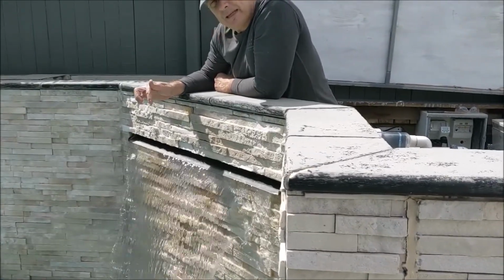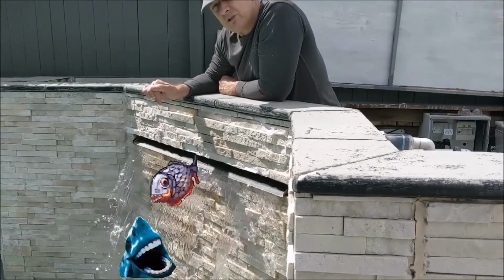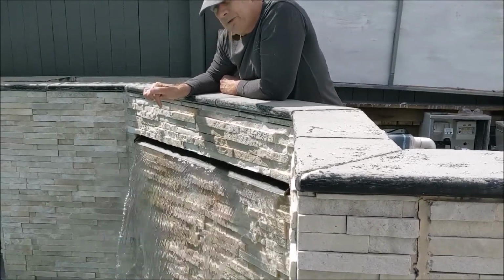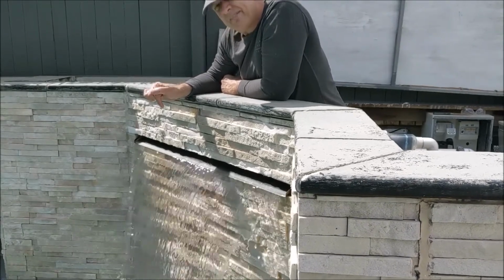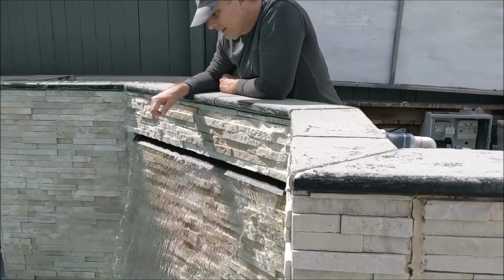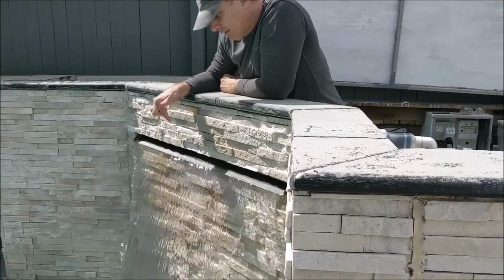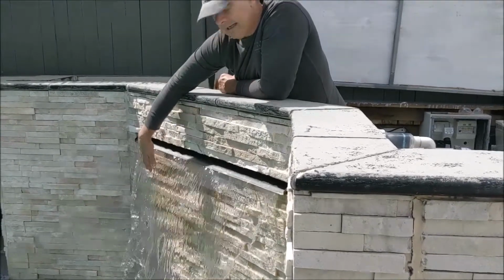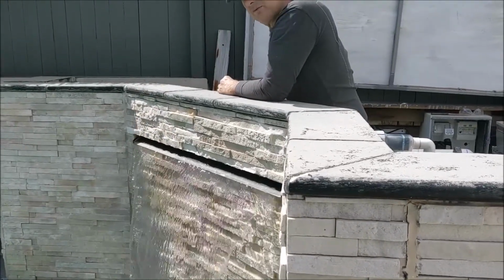I haven't got a power meter, but I reckon the power savings here, based on what I've seen on other tests on single speed pumps, I'll probably go from somewhere around 300 plus watts on my old pump to probably about 50 watts. So we're looking at substantial power savings, about 1/6 of our power usage potentially running on the lower speed. And I'm still getting my aesthetics with my fountain head. I'm still getting pressure on my filter for cleaning.